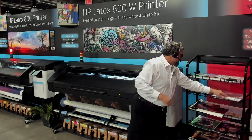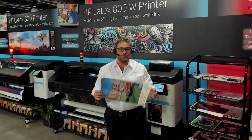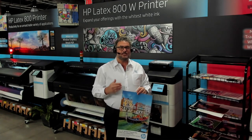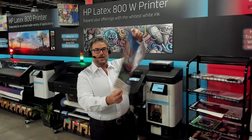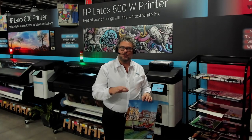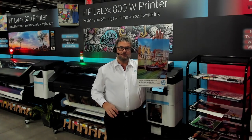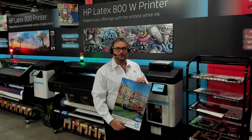Let's get back to the media types. You ever want to do daylight white? Three-layer? CMYK, 160% white in between, CMYK again. The best you'll ever see, right out of the generics. I load the Avery. I clone the generic film, name it Avery, make a couple of adjustments on vacuum. Perfect. We've built all the presets right into the printer.